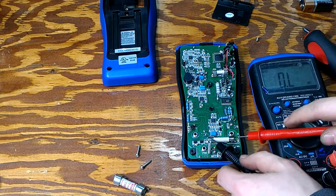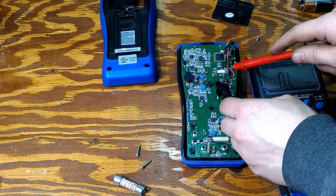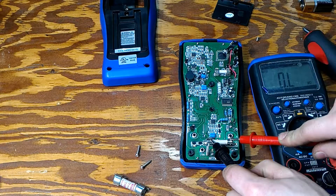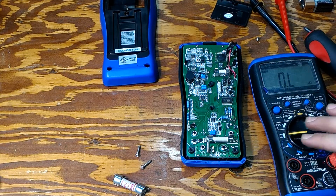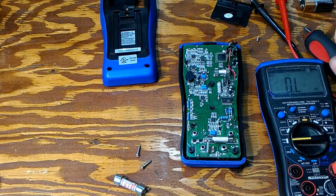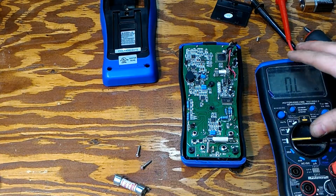The problem is easy: the fuse has blown. This one is good and this one is not. The reason these fuses blow is because they are not designed well — they are fast-blow fuses, which means you reach the maximum current capacity and it blows right away. That's good for protecting sensitive equipment, but it's terrible for meters.